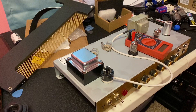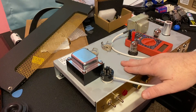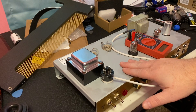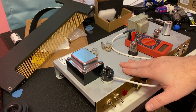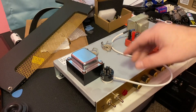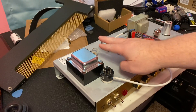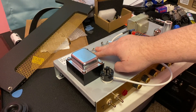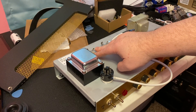You're going to need power, so we're going to plug this thing in, but you also have to have a load on the amp — that being either a speaker cab or a load box. In my case, I am going to use a load box. I've already removed the power tubes because we're going to put the tubes that came with it back in and see what the bias looks like with those.